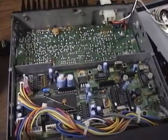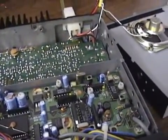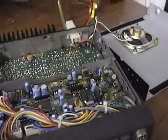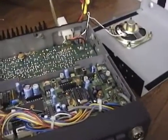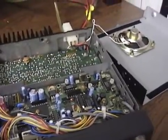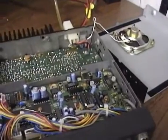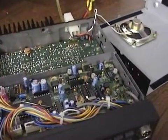It's pretty difficult. There's one other option discussed online, and that is to change out the crystal on the radio. You need to replace the crystal — go from a 22 MHz crystal located there to a 20 MHz crystal, and then after that you'd need to adjust some of the tuning points on this board and also some tuning locations on the other side.